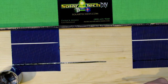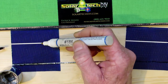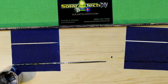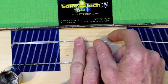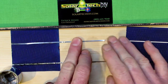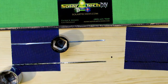Normally you would use this conductive paint to repair a bus bar or bus tab, but to illustrate how well this works, I'm actually creating a miniature pair out of these two cells. In theory, that shouldn't even be possible, because we have a solar cell with a negative face with only one bus bar, so it could theoretically carry the current but not necessarily generate a complete circuit.